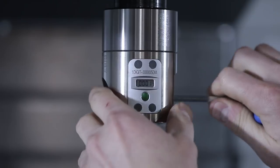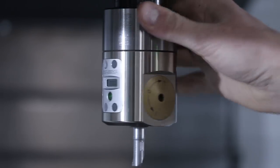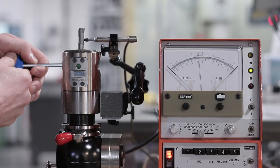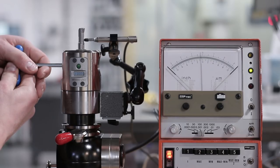The coolest thing about this tool is actually simple — it's the screen. It's the fact that it's WYSIWYG: what you see is what you get. All we're really doing is two things. One, we don't have to read verniers. Reading verniers, we can do it, but this is so much easier. I've always been a believer that the easier a tool is to use, the more likely you are to embrace it and be proud of using it. The better thing is the fact that the screen is perfect on measurement — there's no concern about any inaccuracies in the screw of the adjustment and backlash. Because we're adjusting this head: we adjust for wear and we adjust when we run different materials and different sizes of holes. This tool has been 100% spot on.